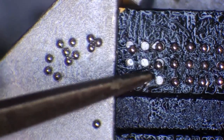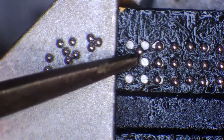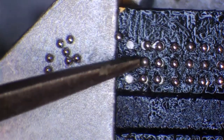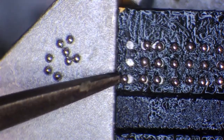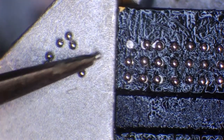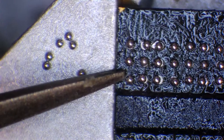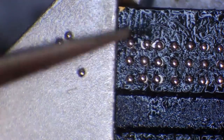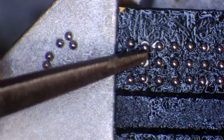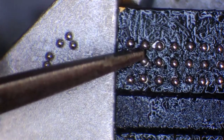So right now we only need another 6 balls. So I'm going to do these ones at speed. And you notice when I got to the edge of the chip there, I used the edge of the jig to my advantage. Because this one was kind of stuck, I rubbed along the edge of the reballing jig. And what that did was create a little bit of extra strength to get the ball off the tweezers themselves. So just straighten those up somewhat.